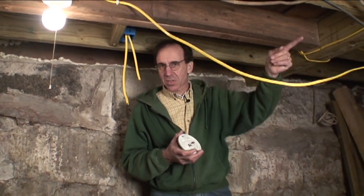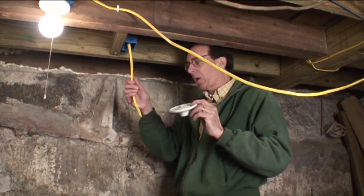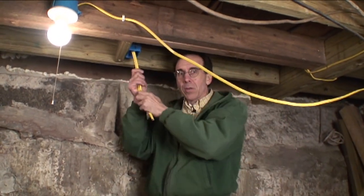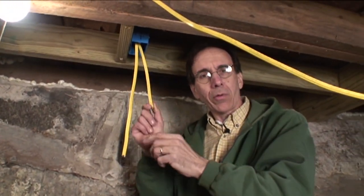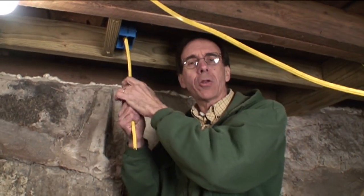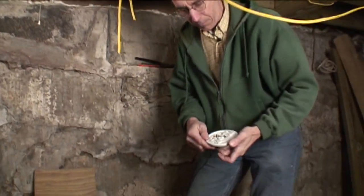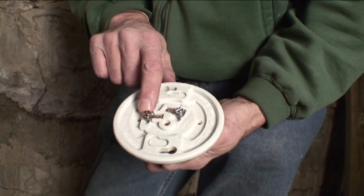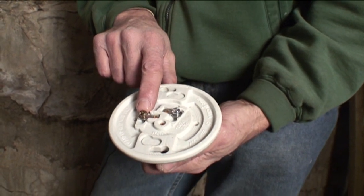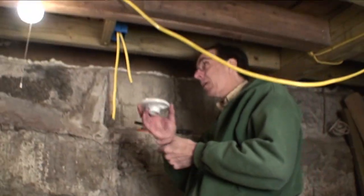These are hooked up to a light switch that interrupts this circuit, with the switch being upstairs at the head of the stairs. We're going to strip these wires back and put the porcelain base up there. These two wire sets — black, white, and ground — are going to get stripped back. The wires are going to get hooked in parallel: black to black, white to white. On the base, we have two different color screws — a silver color and a goldish color. The goldish color is your hot, the silver is your neutral.